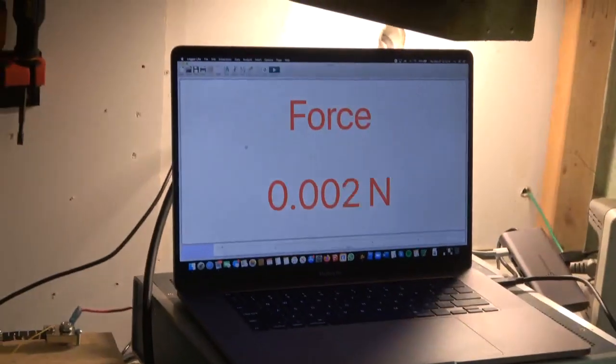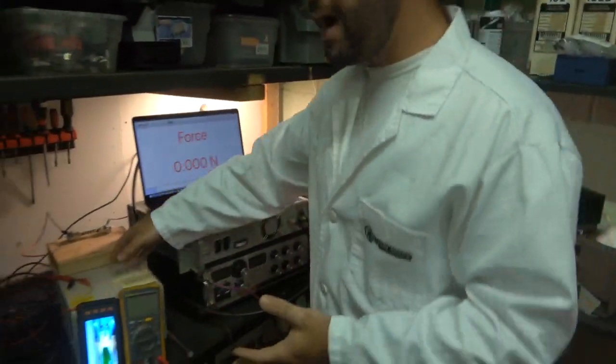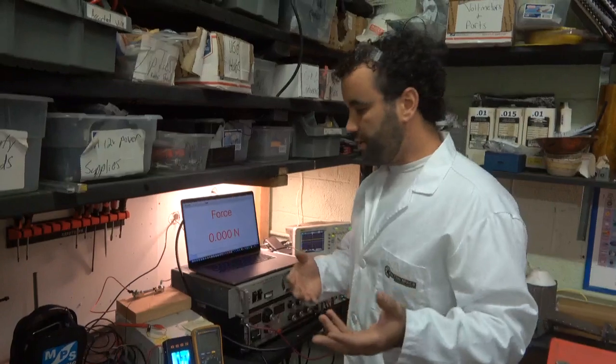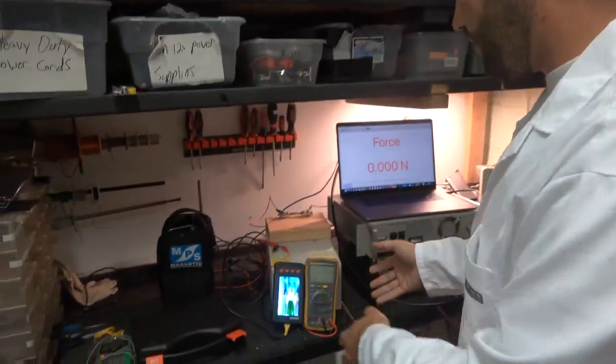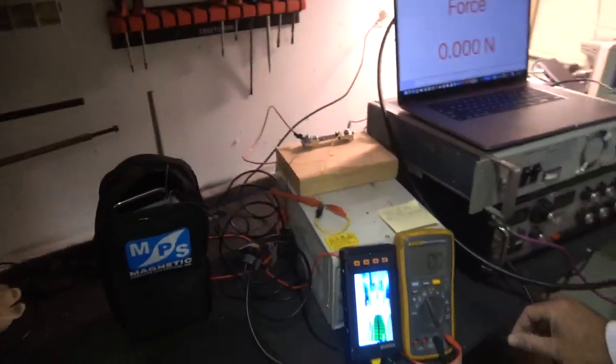This over here is my laptop. It's hooked up to a scale that's inside the Faraday cage, which is on the other side of this wall. For the power supply, this is another thing we had to modify. Jeremiah over here is holding the camera — I actually took it apart. We had to modify the different — basically we just swapped out the front pot. This thing had a 7-turn pot, some weird ratio potentiometer. It had a fine voltage adjustment but absolutely nothing for the current adjustment except for a really cheap little 5K. We swapped it out and replaced the two because they were a 5-volt reference rail, so we got a lot more precision on the current range, and we also put a biasing resistor in there.